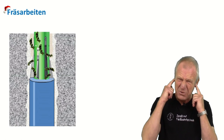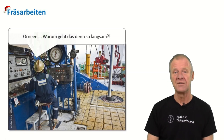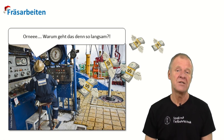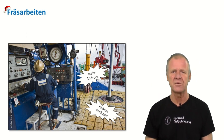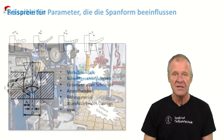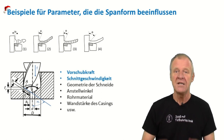That is a pretty rough procedure. It makes a lot of noise and generates a lot of chips, and in most cases this milling process is very slow and results in high cost because the rental rates for drilling rigs are pretty high. Therefore the drilling crew sometimes tries everything to increase the speed by applying more weight on the mill, increasing the drill string RPM and so on. But actually high weight on mill and higher RPM does not necessarily result in high milling speed. It is more related to the chip shapes that result from the applied milling parameters.